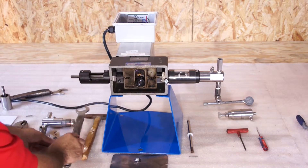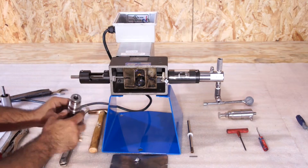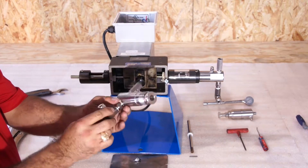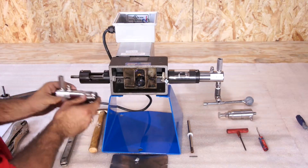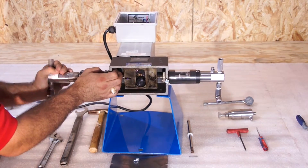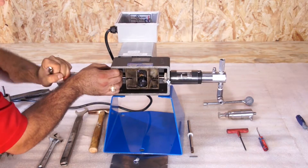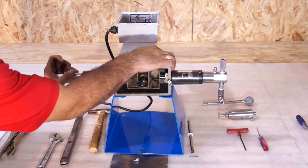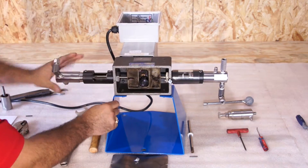Once you've completed that, you're then ready to put the head on. Inspect the head and make sure it's clean before you put it on — make sure there's no debris inside. Put the pump head on; you're working the plunger into the packing. Once you've reached the threads, turn clockwise until the pump head bottoms out on the yoke.